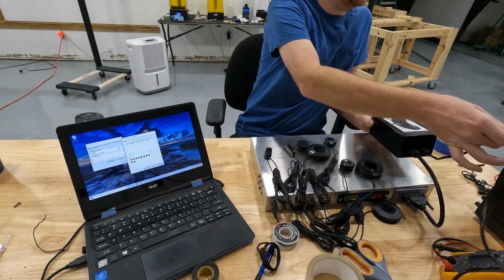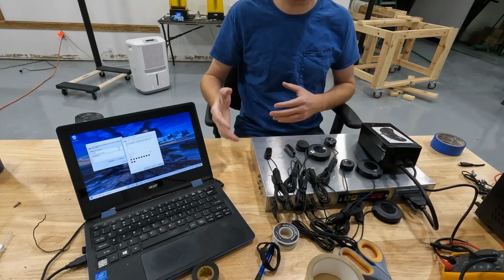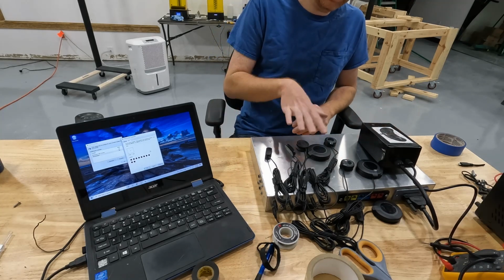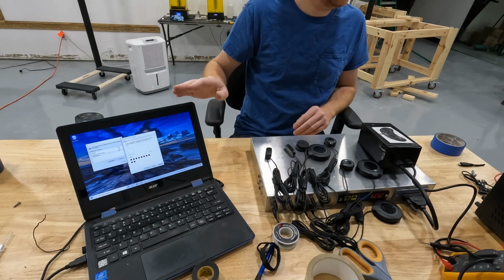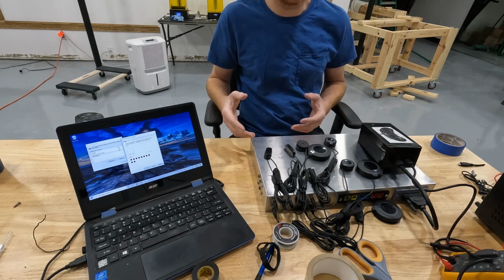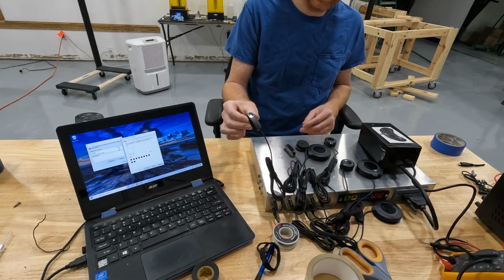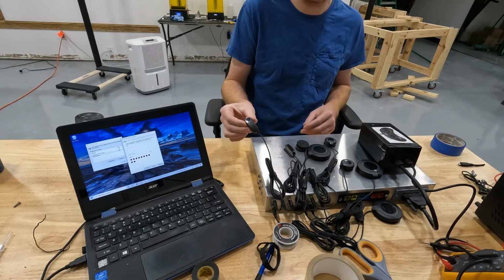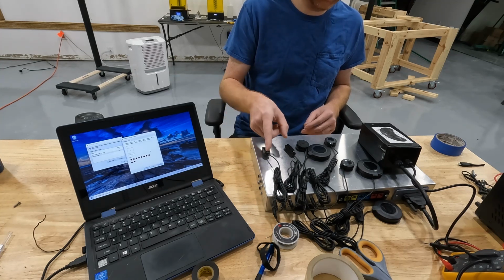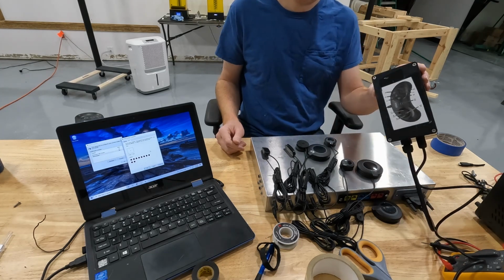And then the other cable coming out of that is the USB cable that would normally interface with a Sega Genesis Mini. But for testing, I want to use the laptop since it is a USB interface so I can see what's actually going on. And then I took all the Logitech adaptive controller buttons out of my adaptive controller kit, and I plugged those into the signals that are being used for the Sega Genesis Mini.